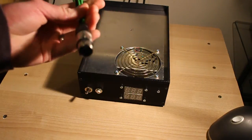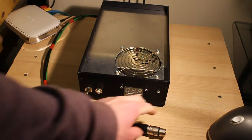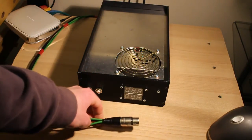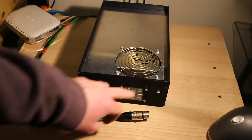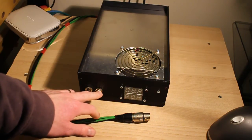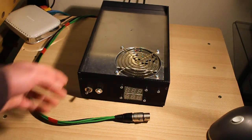Overdone the cabling a bit here perhaps, but easier to use heavier gauge than figure out what the absolute limit is. So the power supply's got two rows of seven segment displays here, which can display the current consumed in each of two circuits. So there's two complete circuits here. One is the heated bed and one is all the rest of the electronics, so you can see how much current is being consumed by each system. Power switch there and a 10 amp breaker on the heated bed, so if it draws more than 10 amps then this will trip out and stop it.